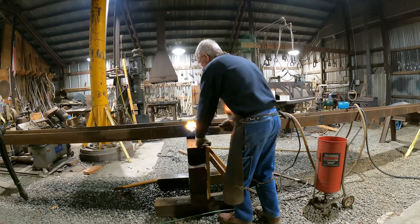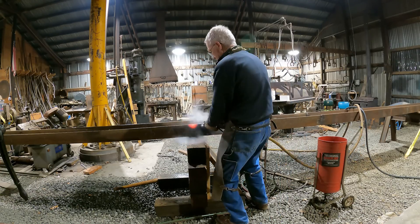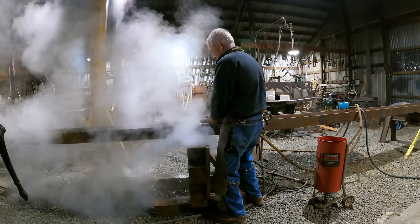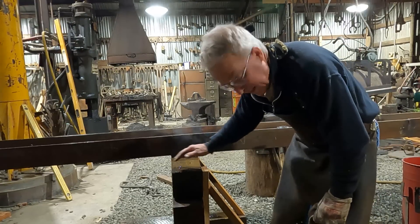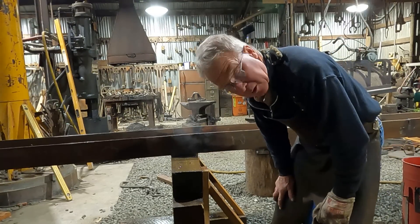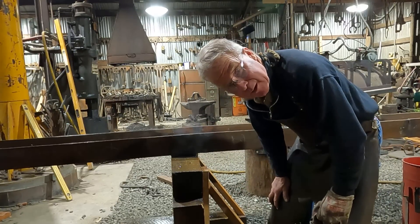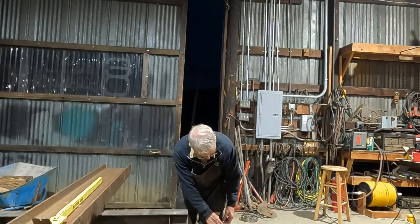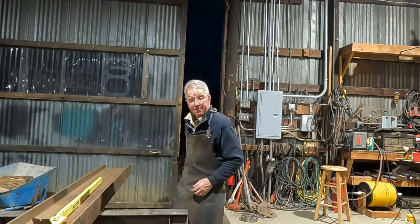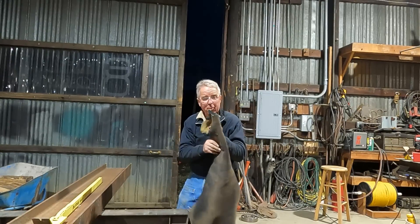I've got to say that by the end of this project, I've learned just about enough about flame bending or heat shrinking to know that I don't really know anything at all about it. I lifted the end behind me up three quarters of an inch so I could get a little freeboard here. I'm going to go take that little block out and see if we're down to zero. I don't think we're going to be as straight as a string, but I think we may be straight enough to use it. I'm cautiously optimistic. We've come quite a ways. I wish that crane wouldn't have quit — hopefully that'll be a small repair in the morning. We can stand this thing up and see what we've got.